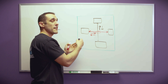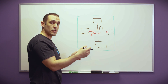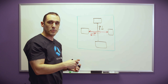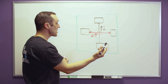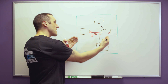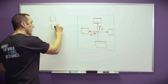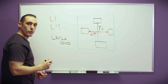When signals get faster they also tend to run at lower voltages, so the induced crosstalk has a greater chance of breaking through the noise margin on the other layer — you could then misinterpret data being sent between components. This can also happen in reverse: signals traveling vertically on one interconnect could induce noise into the horizontal interconnect on the top layer, which would then be read out at the receiver on either end. That's why instead of routing on L1 and L2, we want L1 and L4 for signals, with L2 and L3 as ground in a four-layer stack.